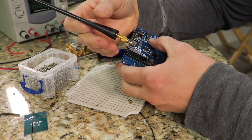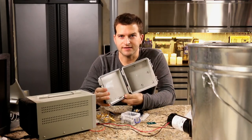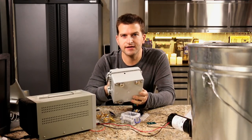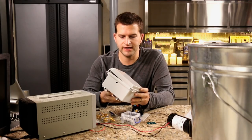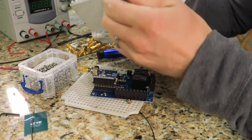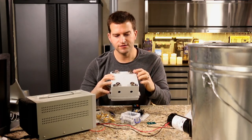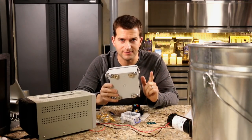The enclosure is from a company called Polycase. For this application you really need a waterproof enclosure — please be careful when buying enclosures. Sometimes they have terrible gaskets that harden and crack, and water gets into your project at the worst time, like when you're on a cruise trying to feed your chickens. Don't cheap out on your cases — always go with a good one. This Polycase comes with nice stainless steel mounts that you can rotate into any configuration. I took rare earth neodymium magnets — very powerful — and used them so I can just clip the enclosure onto the outside of the metal bucket without drilling more holes, because every hole is a risk of moisture getting in.